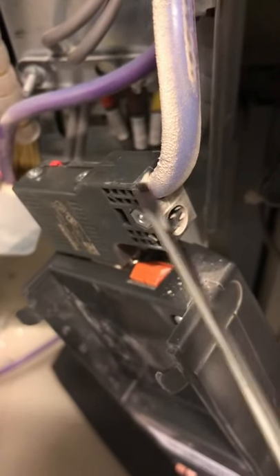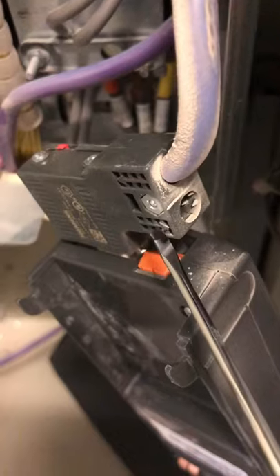I've taken apart the drive and I have it wide open right there. Be real careful with this ribbon cable if you ever mess with one of these. Here's the Profibus bus connector — it's our old one. It has those two set screws right there. You've got to pay close attention to your on and off. This is my last cable. Usually when you have two cables they come in and come out — that's your A1, B1, and your A2 and B2 going back out. So on this one, this is at the end and it has a resistor — this is where the resistor closes so it's in the on position. They usually come prefab as off. I'm going to set this one as on because it's the end of the run.